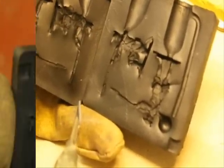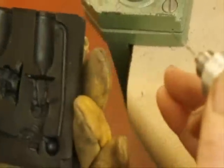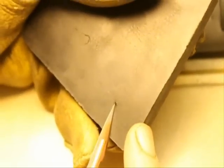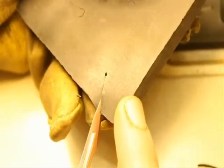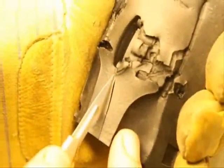Because this mold's ingot blocks direct access to the top of the mold, we drill a 1.5 mm hole just under the ingot branch. Then cut a narrow channel down to the end of the sword scabbard from the drilled hole. From the outside of the mold, cut another channel from the hole to the top of the mold. Cut at an angle away from the ingot hole as much as possible, or it may get blocked when casting.